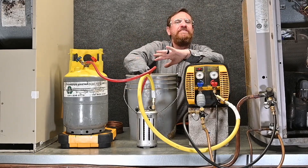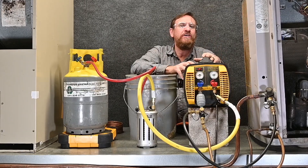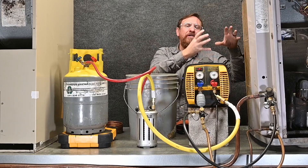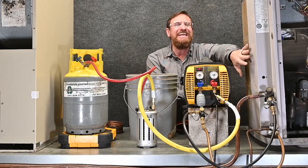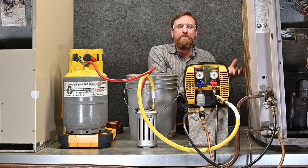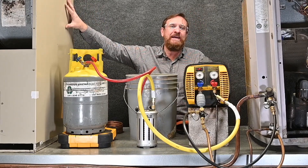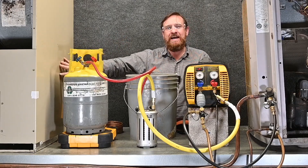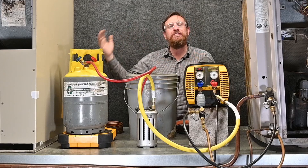That's only one half of the system — we still have the other half to talk about. When we were pulling all that refrigerant out, the liquid came out pretty fast but the vapor took a lot longer. The pressure drops on the suction side, and that liquid refrigerant is boiling from liquid to vapor inside the compressor oil. One option is to turn the fan on in the air handler, moving heat from the house across the evaporator coil. By keeping that evaporator coil as warm as possible, we keep the pressure up on the suction side, which helps speed up recovery.